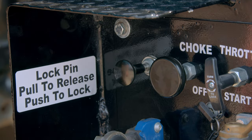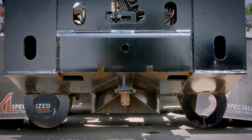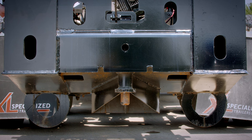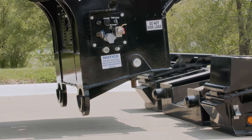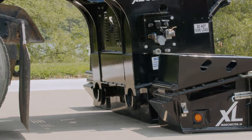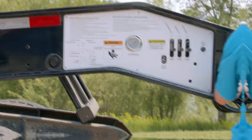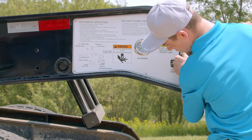When you are ready to reattach the XL hydraulic gooseneck, you must put the air lock pin back in the lock position. This lowers the lock pin and allows it to automatically engage when the gooseneck is reattached. Back the trailer up to the main deck until the spring-loaded lock pin engages in the main deck lock plate. You will hear the pin engage during this process. Some support arm adjustment may be required to properly reattach the gooseneck.